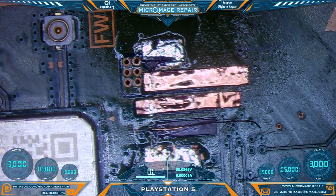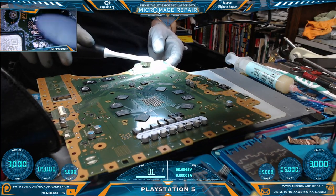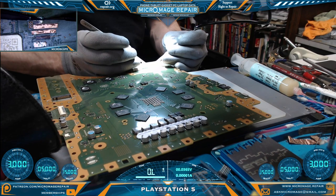The next important task is to get all the flux we can off this board and out from under those pads. Flux will interfere with our ability to make it nice and secure with UV coating. Any flux under the UV coating will be a problem, so we'll be cleaning thoroughly here. The ultrasonic brush is great for getting under things.